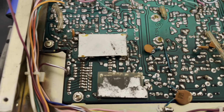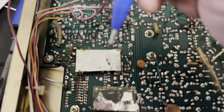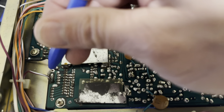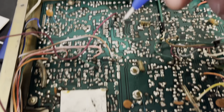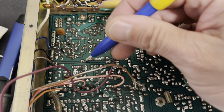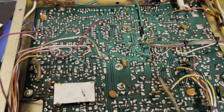You'll see on the Internet where they say you've got to have a hard ground on the other leg of the clarifier opposite your 8 volts. But I've found on these 138XLRs and TRC-449s, that's not necessary. I don't ever move the other leg of the clarifier potentiometer from where it's originally terminated — I just leave it alone. The only thing we're going to do is lift this brown-white wire and re-terminate it over here onto this trace to get a steady, constant 7.8 volts. Then we'll mod the rest.